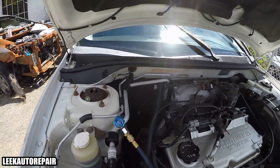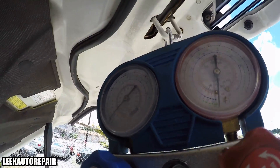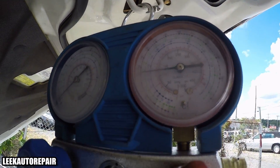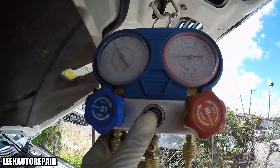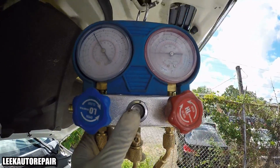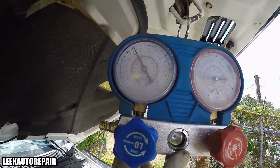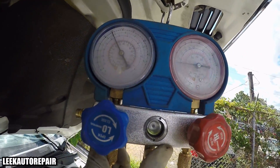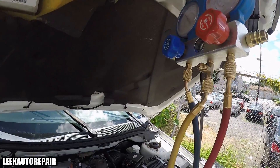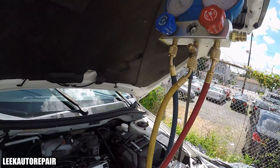Now I'm going to open up the valves, and as I open up the valves you should see movement on the gauges. I'm opening up the high side. Pressures on both sides should kind of equalize — it'll even out. This should give you ambient temperature, also called static pressure. The low side is going up slowly but the high side is already ready to go, so they should be almost equal but not exactly — that's your ambient static pressure on a good working compressor.